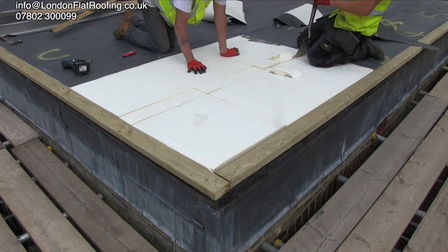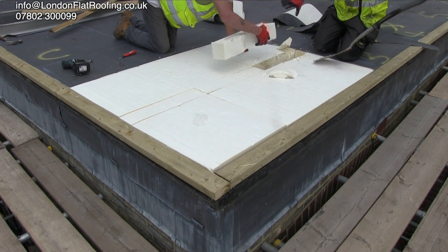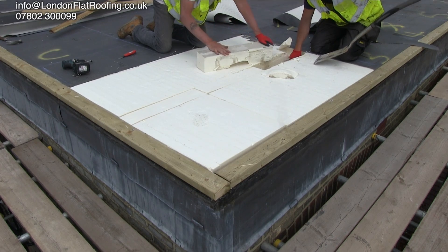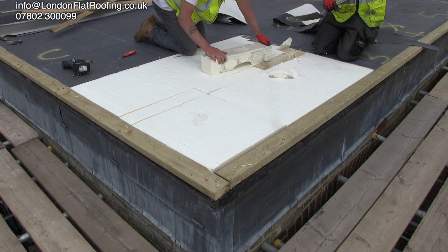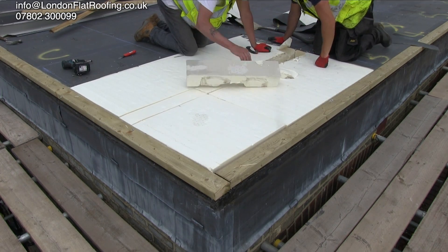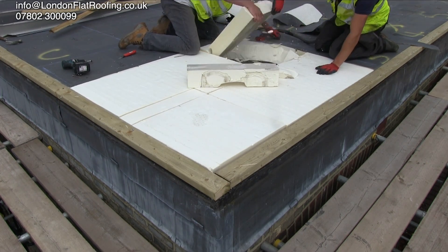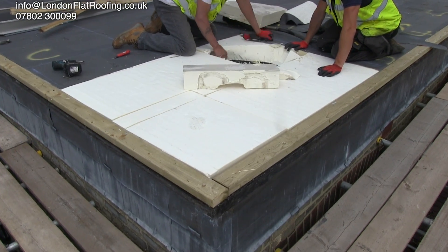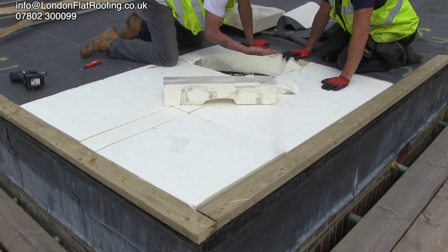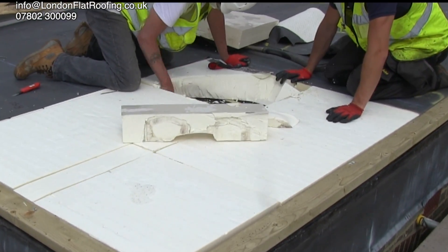I'll put a link below to another video talking about how this insulation is actually glued down. As you can see as this comes out now — I put my hand on the back of this and you can see there are dry areas and wet areas where it's stuck to the old roof which is underneath it. And when I pull this area out — again, you know — absolutely perfect example: this is exactly where our two circles were and the water was indicated by the equipment.